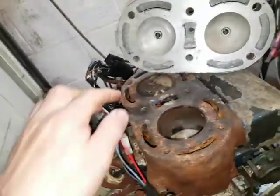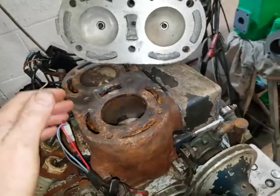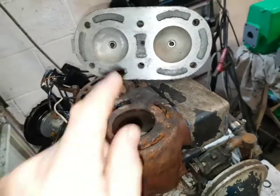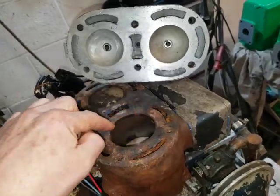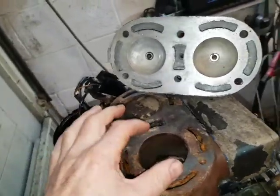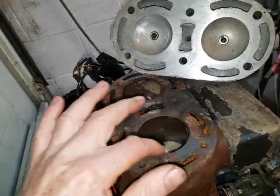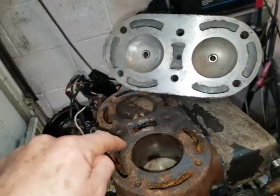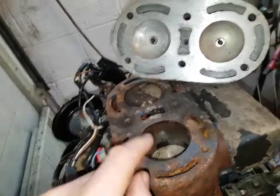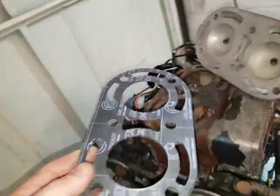Now, if this was a car, and I know because I've built literally hundreds of engines, the head gasket, which you squash down with powerful bolts, has a steel seal in the plastic, and so you get a really nice high pressure seal where you need it between the cylinder head and the cylinder block or cylinders. Now, what I notice on this is a brand new head gasket, supplied by Dolphin recently.